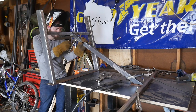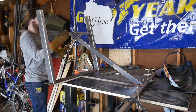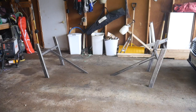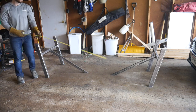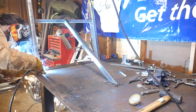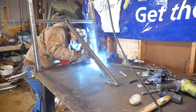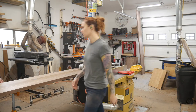I threw a piece of melamine down because the table has a bow to it and I was hoping the melamine would take that out a little when welding, because I didn't want the table to be wobbly. Just kind of line it up the best I can — if I had some sort of fixture it'd be way easier but we're making do and it actually turns out pretty good. Testing the layout and figuring out how everything is gonna look for a nine and a half foot table. Now that I'm happy with how everything looks, we're just gonna weld this thing solid, tacking the piece to the table so when I weld the back end it wouldn't pull left or right. That's pretty much it for welding — now let's wrestle the rest of this tabletop together and get these two halves through the planer.